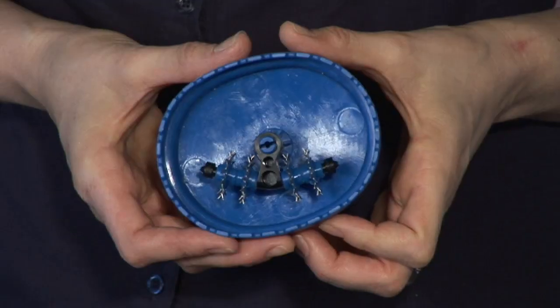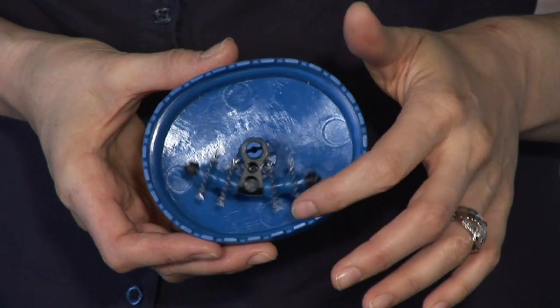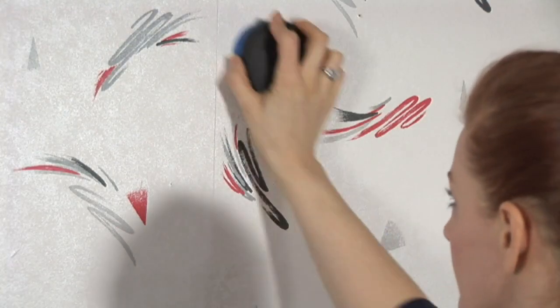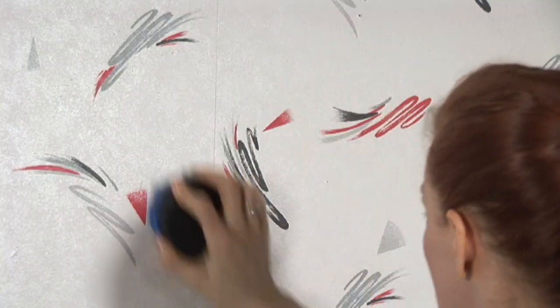So the one thing that you need to remember is to go slowly. You want to first score it with some kind of a cutting tool. A claw works really well — it's just a handheld plastic tool that has cutting blades on the underside. You move it across the wall in a sweeping circular motion.